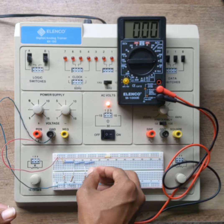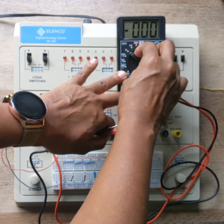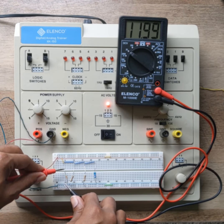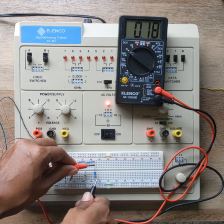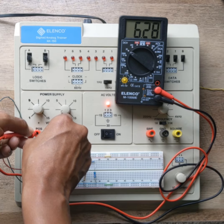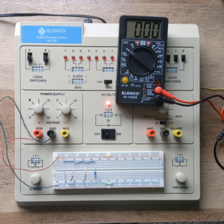When you're done, put it back. If you wanted to measure voltage — like the voltage across each resistor — put this on volts and just hold the probes on either side. All of these should have the same voltage, about 12 volts, because they're all in parallel with the voltage source, so they all share the same voltage as the source. That's how you would do Lab 4, and specifically that's a quick tutorial on how to break the circuit to measure current.